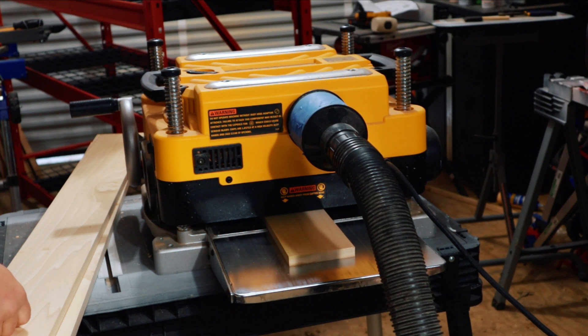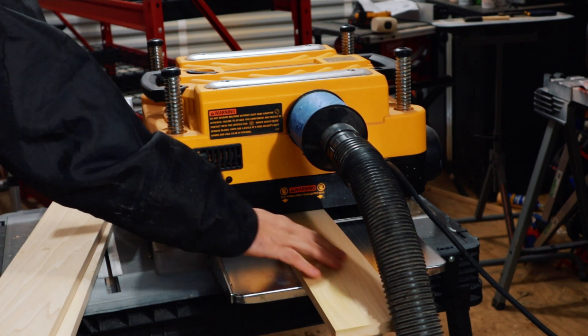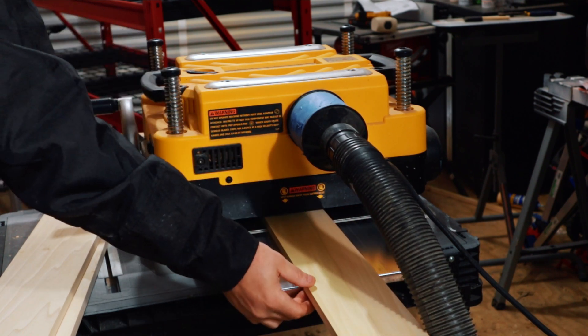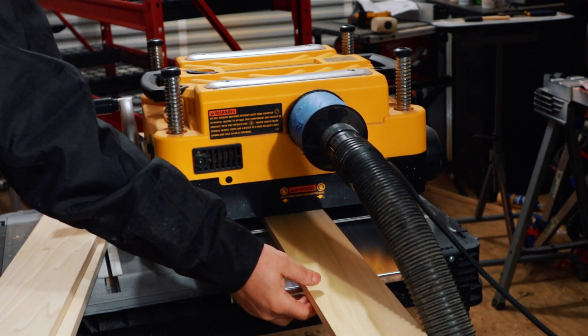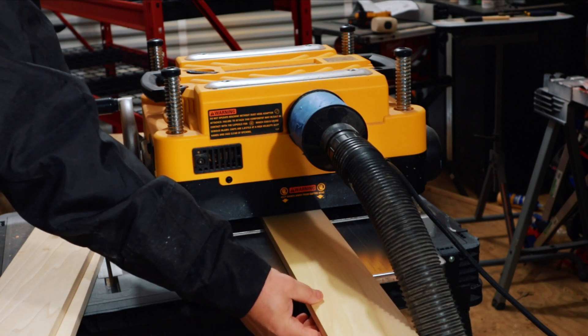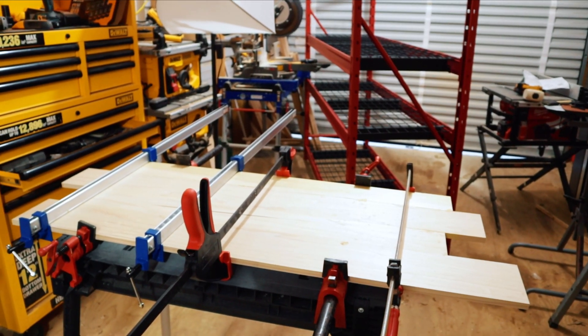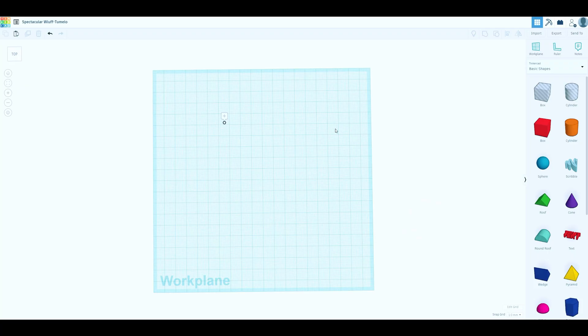I did both edges and one face plane. From there I took my jointed pieces of wood and ran them through my DeWalt planer. If you don't have these tools, most lumber yards will do this for you — you might pay a little bit more than rough lumber, but it's worth it. Once I was done with that, I glued up all the edges, clamped them together, and let them set overnight.